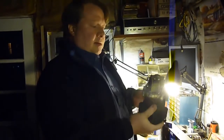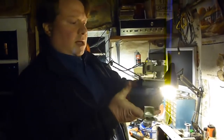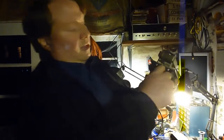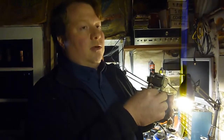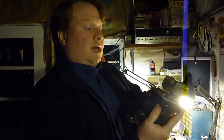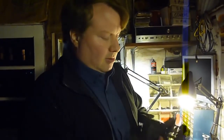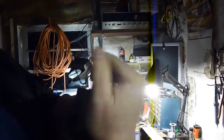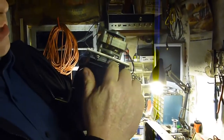I get comments from people asking me why their slow motors aren't working right — the fast motors work, the slow works on the bottom, but the slow doesn't work on the top. There's an adjustment here. This solenoid that touches the disc has to touch it just right. Too loose, and it doesn't push the disc, which pushes the pulley. Too tight, and it will bind up and won't retract, and it will add extra pressure and load on the slow motor, which is not good either.